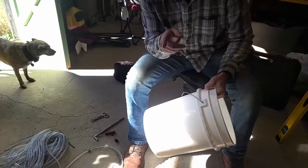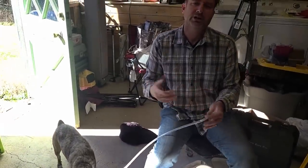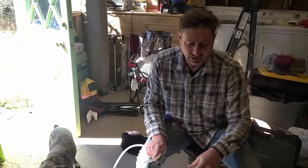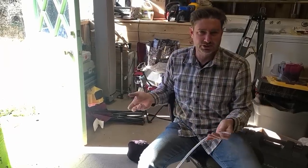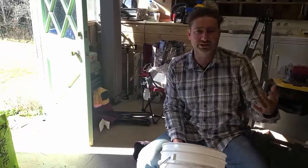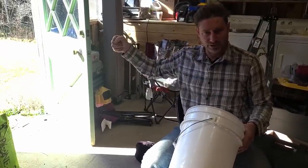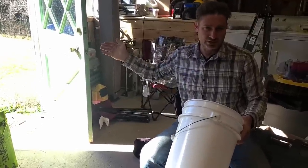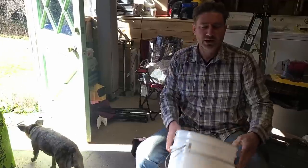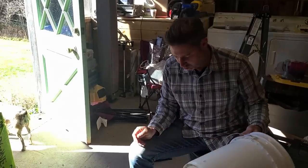We're switching up the water level. Last time we just used the tube. We put blue water in it and filled it up, clamped one end and moved the other end around. The problem with that is there's too much water displacement. So using a bucket, we will have basically an ocean of liquid at our disposal, and when you move one end around with the pole, it's constantly pushing water into the bucket or taking water out of the bucket, depending on whether you're high or low on your level job. So here's what I think we should do.